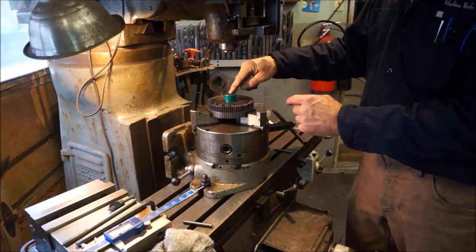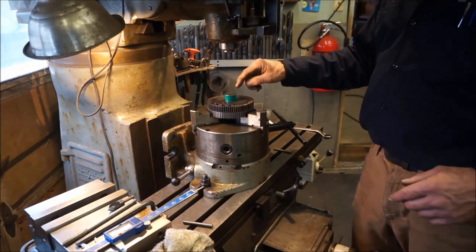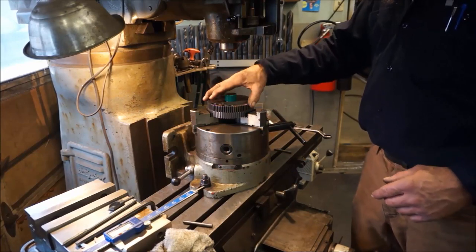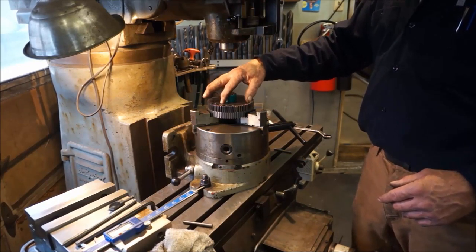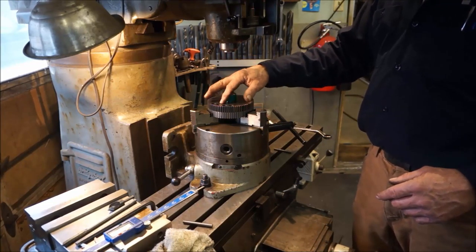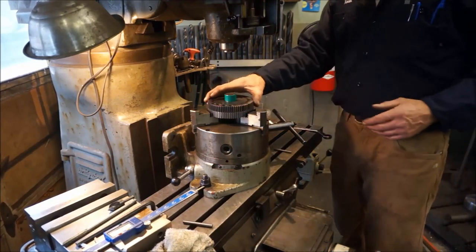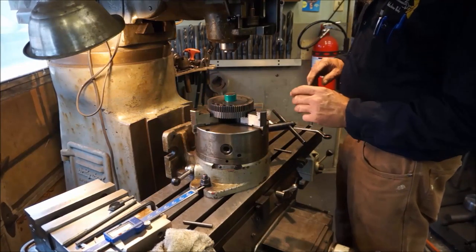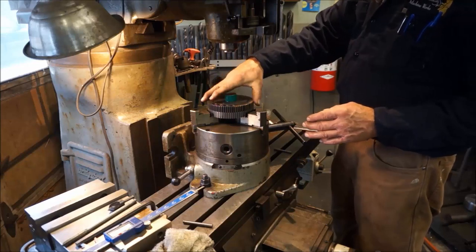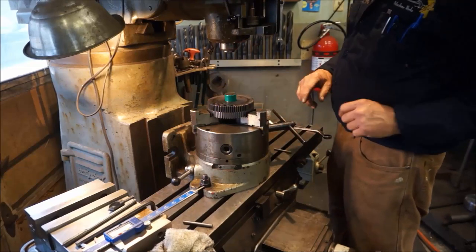It does have a little bit of play in there, because this is a broach guide. So we're going to be picking the happy medium in here. But by having the center line of the whole index head and coming over, we're going to be able to pick the motion of this, but pick center of that. Then after that, we'll be dropping in a pin location from this hole, and everything else will be in relationship to that hole. So that's how we're going to compensate for the play that we actually have in our broach guide here, and still let it give us a drop in and out checkpoint for each of these hole locations.